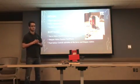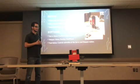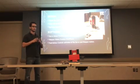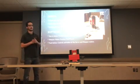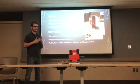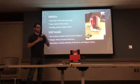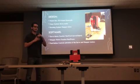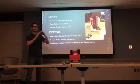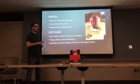To get this done, I had to get the measurements of the cards and then made the design of the frame to fit the cards in there using AutoCAD. Then I 3D printed the box, and the first problem we had with this was that there was no angle of inclination inside for the cards to slide down. So I had to get a piece of foam and increase the angle so the cards would slide down whenever the gate opened it.